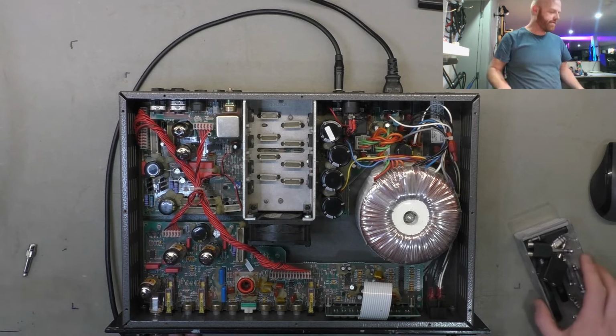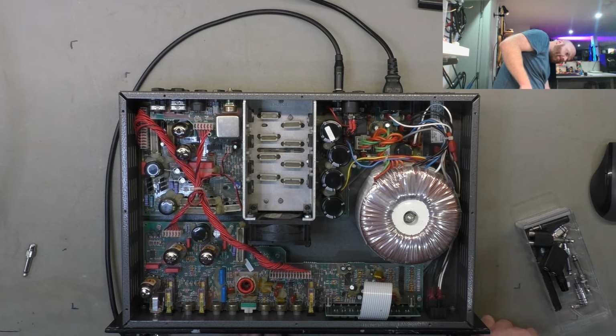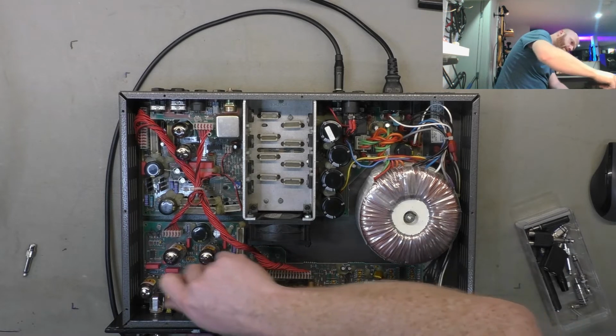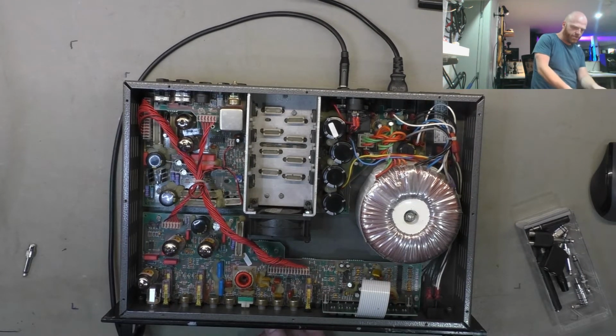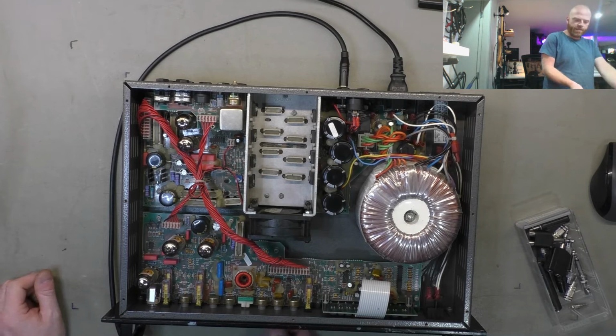So we've got the signal generator turned off. We'll crank the gain all the way up. Master all the way up. It's very quiet. We'll unplug the input, as we were getting before, lots of noise. Now we've got that new jack in there, dead quiet. So that's good. So everything seems hunky-dory, just a little bit of scratchiness on that master there towards the end of its travel where it doesn't get used much.